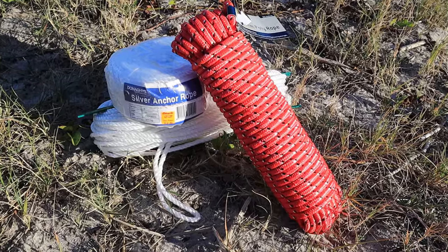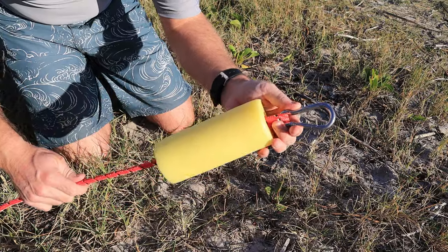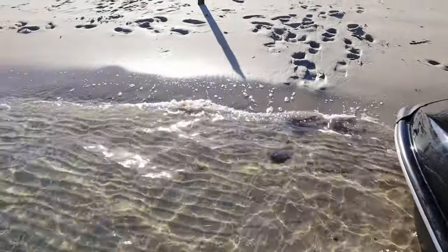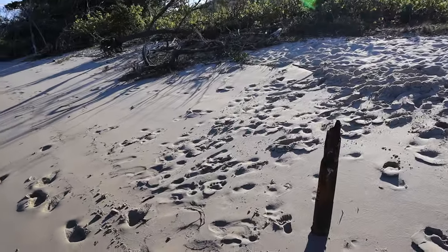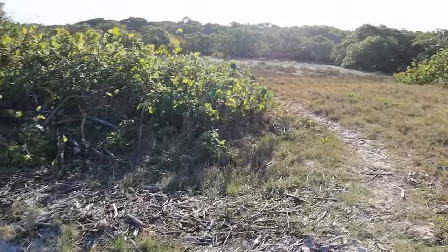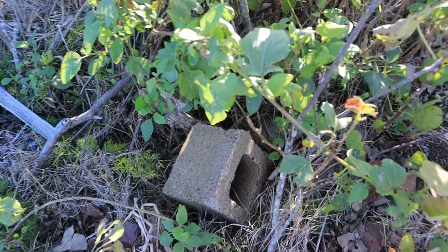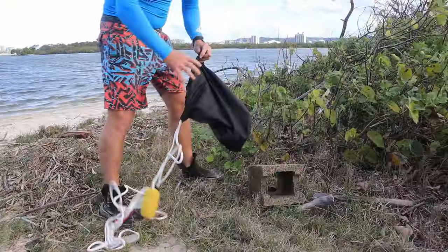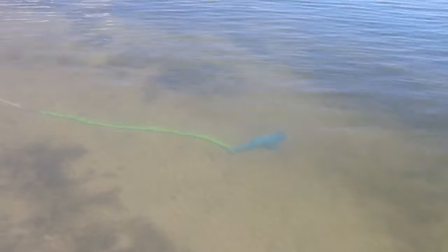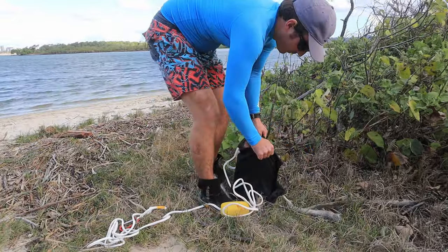For this demonstration, I'll use a much shorter bright red rope. On both ends of the loop rope, you attach a snap hook. You can also attach floats, but it's not essential. You can use any type of anchor with this system — each anchor has its own advantages and disadvantages. If your vessel is relatively small like mine, I like to use a sandbag anchor, provided I can find some heavy rocks or debris ashore to fill it with. Don't risk filling it with sand or mud, as it's likely to wash out and empty over time. Sandbag anchors are small and light to store on board.